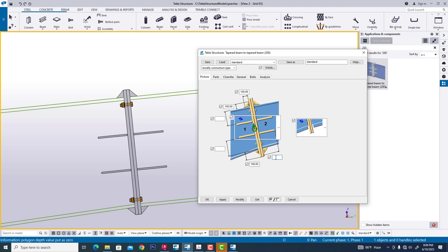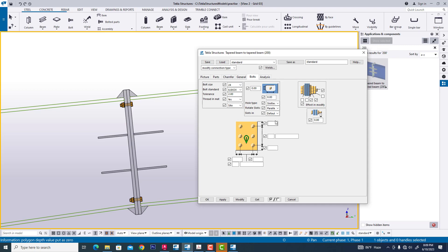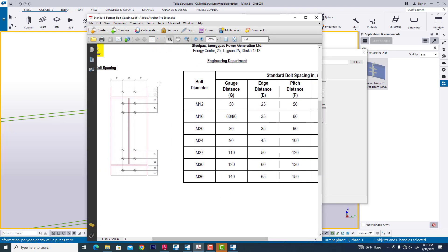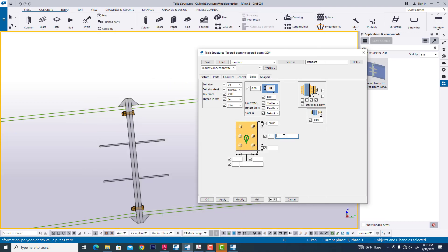We are also setting stiffener height to 100. Now we go to part — our end plate will be 24 mm. At the stiffener, we use 8 mm and 8 mm. Now we go to our bolt and set placement at 100. The minimum edge distance will be 50. Now placement is 8 bolts. The edge distance will be B plus C equal to 24 mm, 100. Now I am changing this spacing as per our requirement.